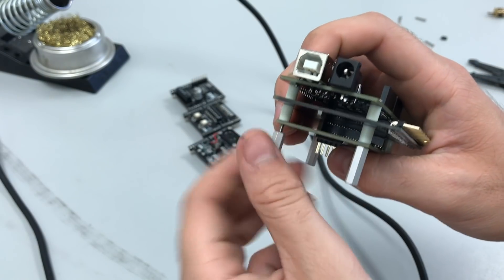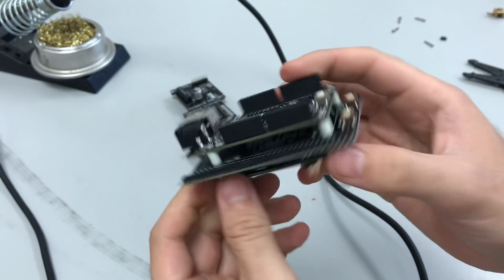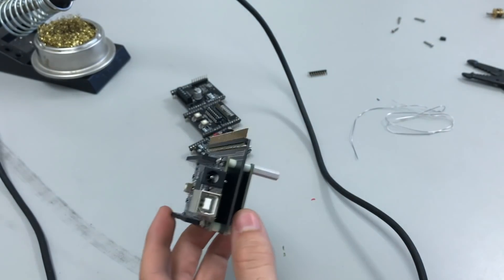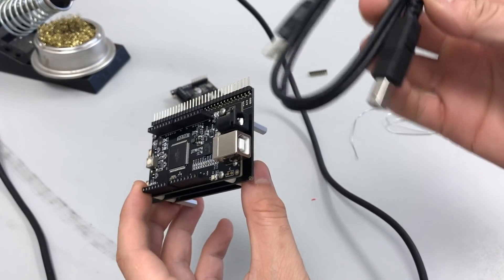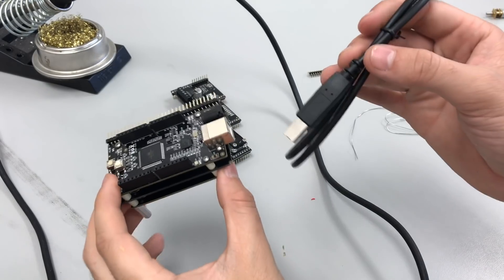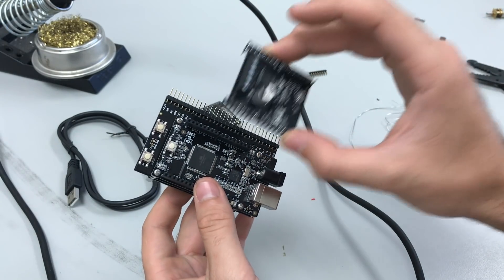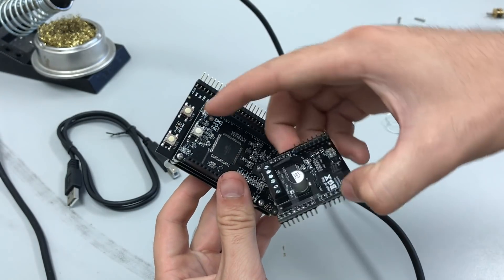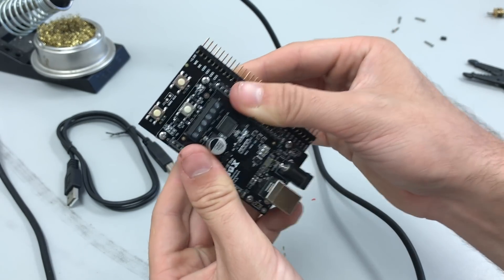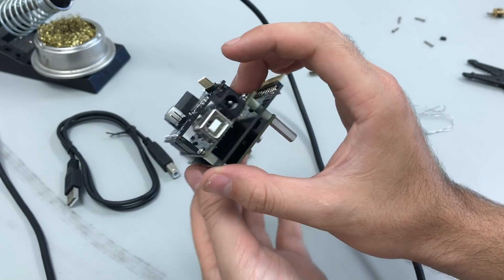Now everything is flush and connected on all three boards. The only thing to add is the four standoffs, which go on the bottom to hold the board up from touching the table and screw directly onto the long screws going through all three boards. You don't have to tighten these as tight as possible since you might need to take this apart — don't snap the corners on the boards. Recommend putting your finger on the top of the screw and tightening the standoff with your other hand rather than using a screwdriver. So now you have the Mupad kit fully assembled. Just connect the USB cable to your computer during the first lab to make sure everything works. Always install backpacks with the groove on the top going over the reset button on the Mupad, then press evenly on both sides.